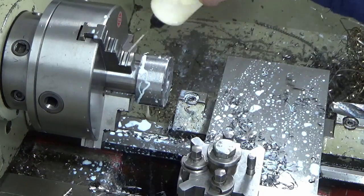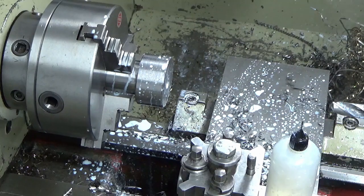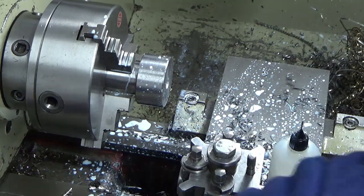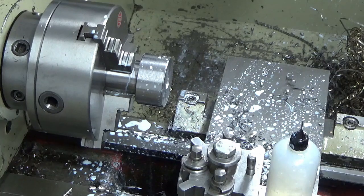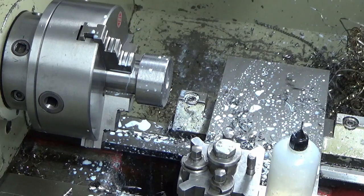This is the problem when you're machining unknownium. You don't know what it is, where it's been, whether it's got hard spots in it. It's very, very strangely behaving, that. When you deal with a material that work hardens, normally if you work harden the surface, your drill just won't cut anything at all when you go back in.